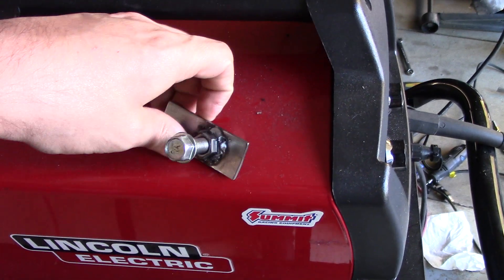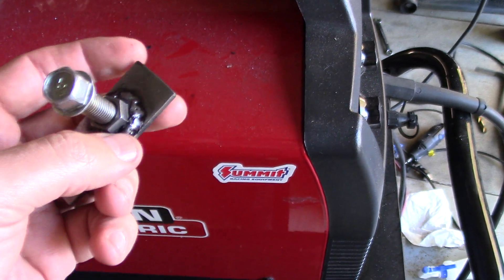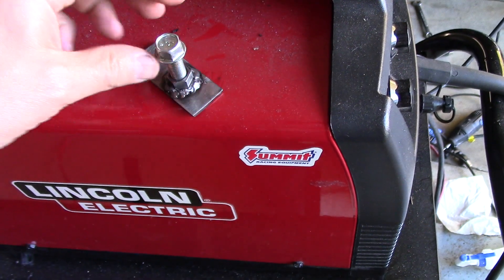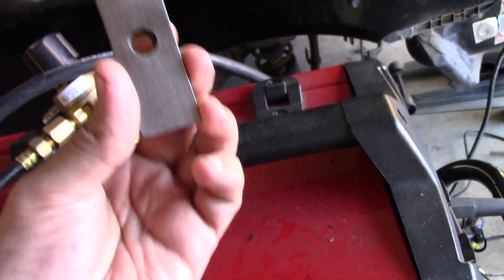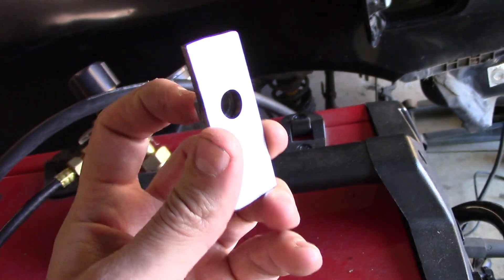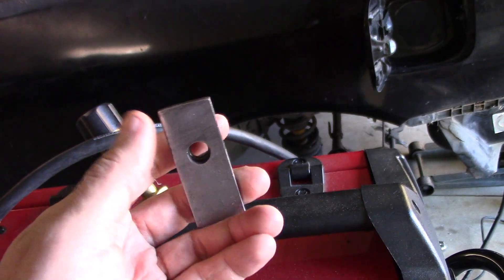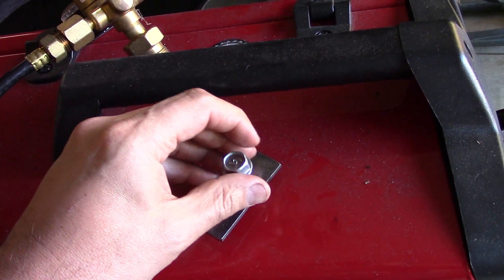Here's the update with the gas tank. What I did was I got a bracket and welded a nut to it, and I'm gonna grind this down smooth around the edge. For the mount, I drilled the hole in the metal — this is the mount for the gas tank. The back bracket is done and the front bracket is gonna be a rod. I drilled the back, pushed the plate up against there, and the pole will go through here.